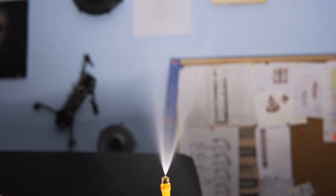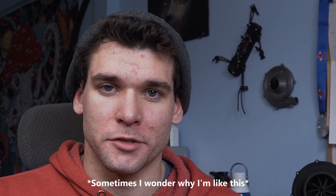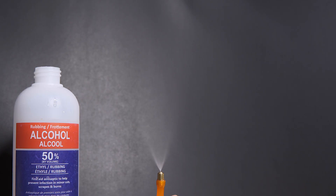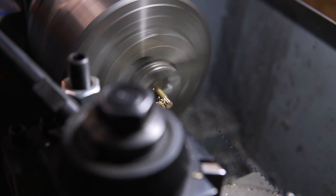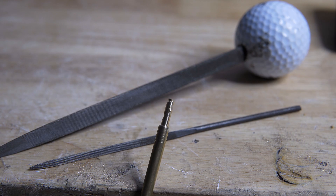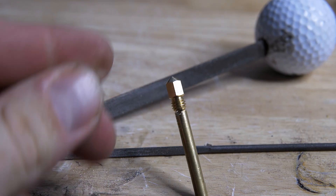Instead, I came up with a cheeky solution that makes our nozzle spray a fine mist. The key is to create a vortex inside the nozzle prior to expulsion. The vortex imparts angular momentum to our stream, causing it to expand radially outwards as it leaves the nozzle, rather than staying in a tight jet. I achieved this by boring out the printer nozzle to 1/8 of an inch, then preparing a 1/8-inch insert that press fits into the nozzle, and filing a spiral groove into the insert. The spiral is what gives the fluid its rotational energy — and ta-da! We have a working spray nozzle.